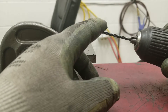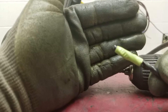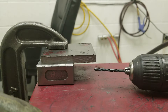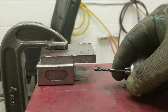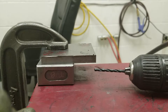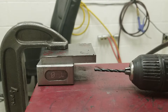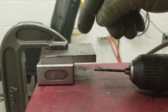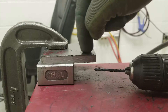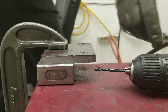The drill bits I'll be using are just straight-up fractional: a 1/8 inch and a 15/64th, and I've marked it with tape so I don't accidentally go too deep. The first one you're going to use is your 1/8 drill — any drill bit bigger than 115 thou works, just don't go too big or you'll blow the hole open. First, lay out the location of the four holes and center punch them using a drill bit or a proper center punch. You need to center punch before you drill or the bit will wander.